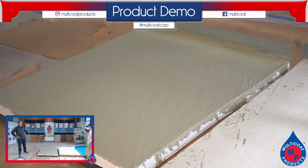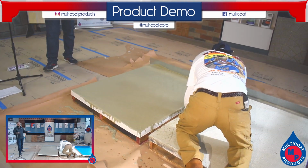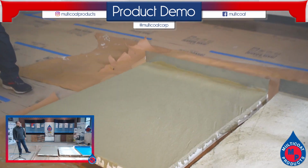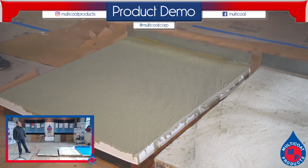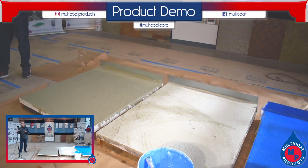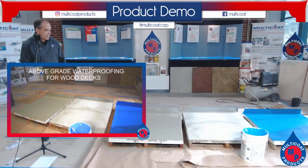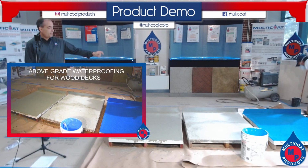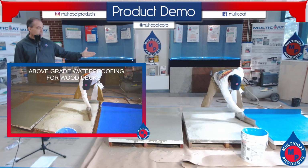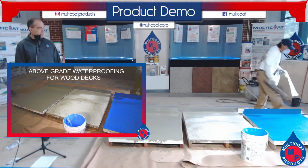So next we're going to do our first coat of Multicoat on our polyester fabric. You have your multi-base coat all dry, and you usually have a metal flashing going up against the building. What we ask is that you embed our polyester stitch bond fabric, which comes in rolls that are 12 inches by 324 feet. You can cut it, or you can use it in that shape. And what we ask is that you embed our polyester fabric up the flashing and onto the deck using our Multicoat first. So that's what Alfonso's going to do here real quick.